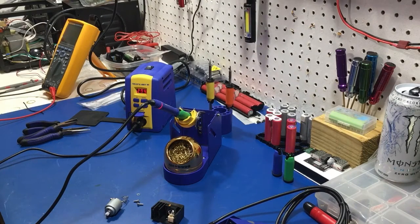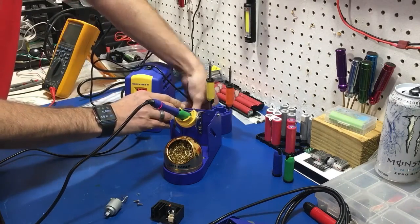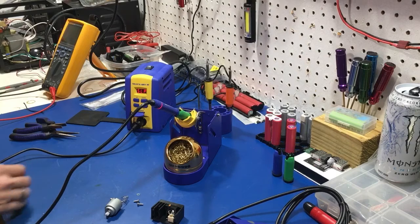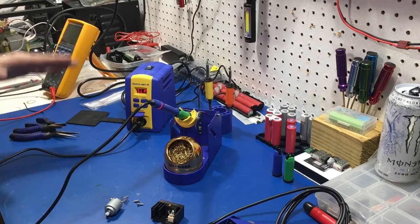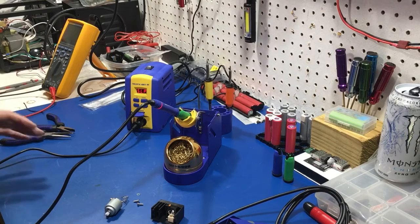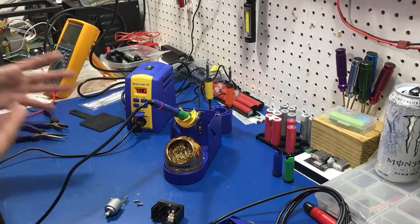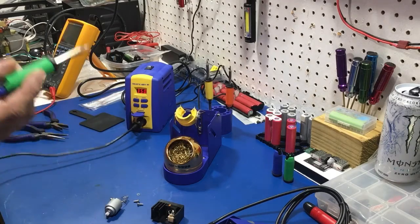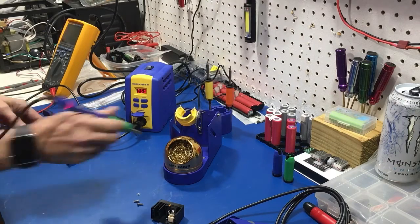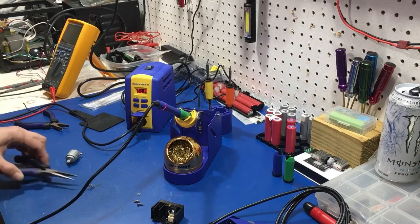After it hits 350, it can't go to sleep without the actual cable hooked up. Sleep — SLP. So now it basically drops down to about 200 degrees Celsius, which brings it under the temperature where the tips would oxidize due to the corrosive properties of solder. It actually extends the life of the tips, which is a really nice feature. As soon as I pick this up it should bring it right back to 350. There it is — beep, done. Really nice. I like that. And back to sleep. Perfect.